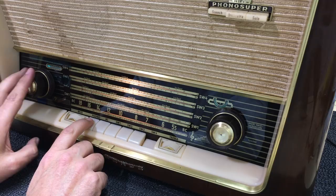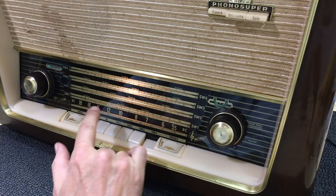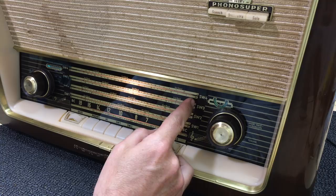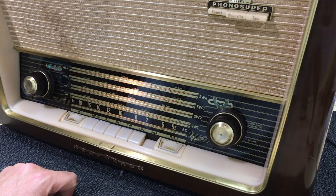Well, that's it. What we saw here was quite a bit on medium wave. This is 7:30 p.m., so the lower shortwave bands have very little. Shortwave 1, there was nothing. Shortwave 2, you start getting something around 9 megahertz. Shortwave 3, well, this time of the day is when you get most of the reception, and some of it on shortwave 4 up to about 18.5 megahertz. What we find is that it's actually very clear when you are in the band that's most active during the time of the day that you're listening.